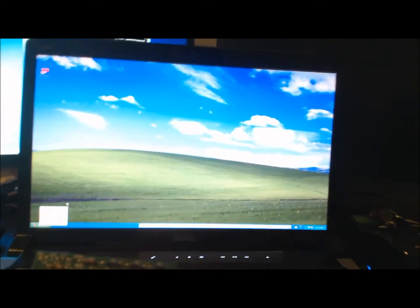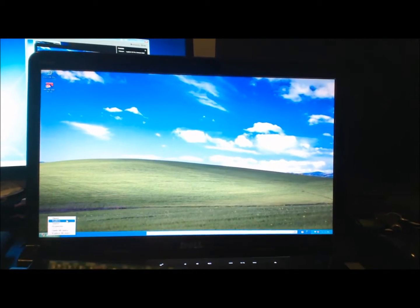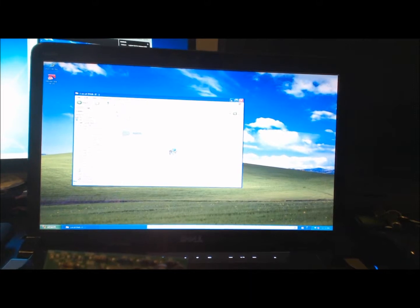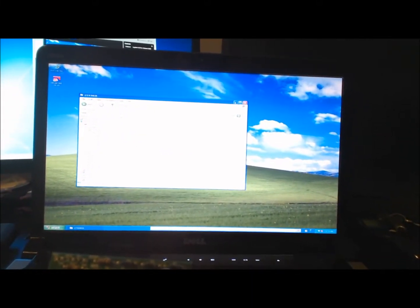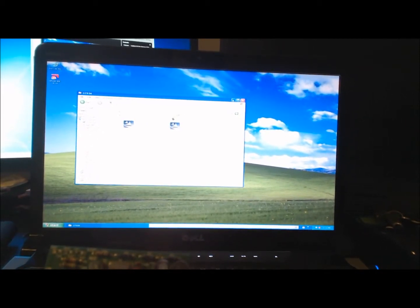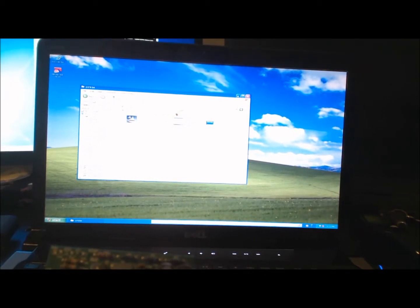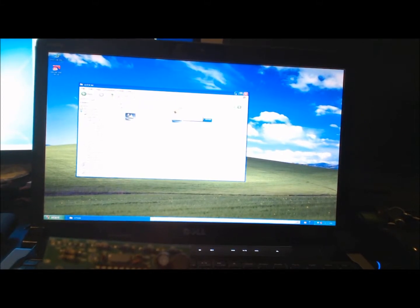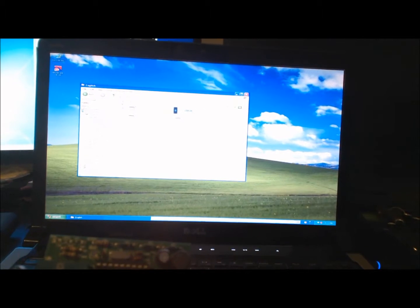Then the next thing you want to do, just fix up this camera. The next thing you want to do is, so you've searched on the internet for OT934CD. You've installed the driver. You just drill down into it until you find the driver and then install the driver. That's all working. You know what COM port the device is on. And then there's a program called Micro Pro. You just double click it.